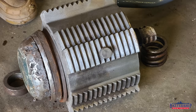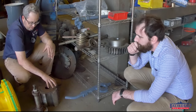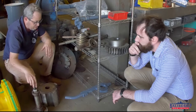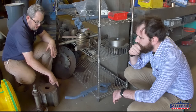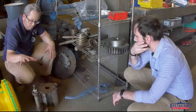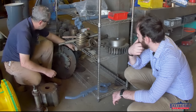This is all disassembled because we're here restoring these guns. There's a link in the description below to the video where we talked about the restoration of the guns. We have various parts from the 5-inch guns here, and a chunk of what we have is the breech assembly. The three major components for the breech assembly are the breech plug, the mushroom, and then there's an operating handle, and the carrier is actually sitting right here. You can see the interrupted thread here that matches up going into the interrupted thread on the breech itself.